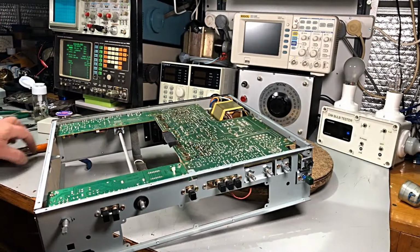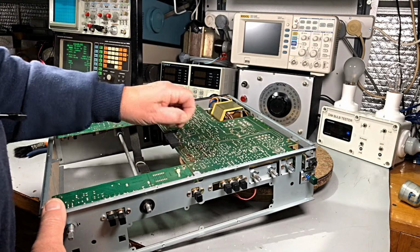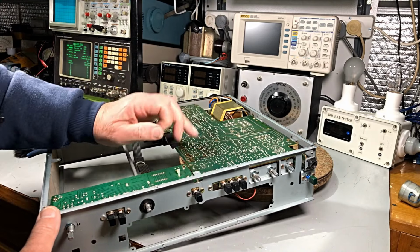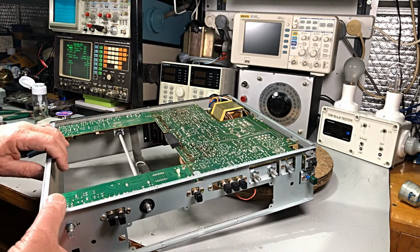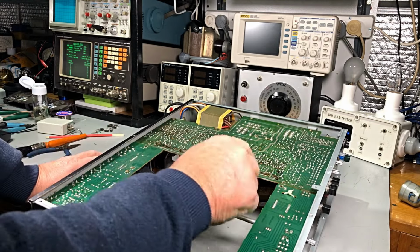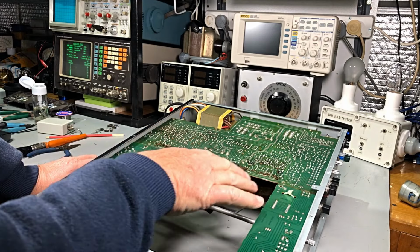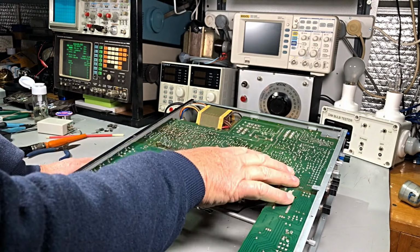Right, well, I think they'll come up okay. We'll be able to resurrect the tracks once I get it under the Maggie lamp. And when we're putting the new transistors back in, I don't think there'll be a problem there, which is good. So I'm going to go ahead, clean up the rest of the board where the other transistors are, where the power transistors go. And then we'll change some caps down the track.